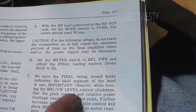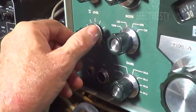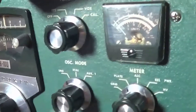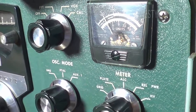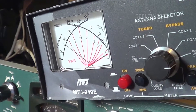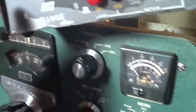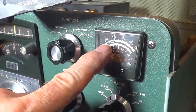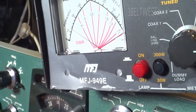Then you want to go through and turn the mic level control clockwise a little bit. Mine doesn't really change it that much - there you go, you start to get some. Up here is the power meter. Here's on 50 - we're down about 5 watts, there's 100 mils, looks like about 20 watts.